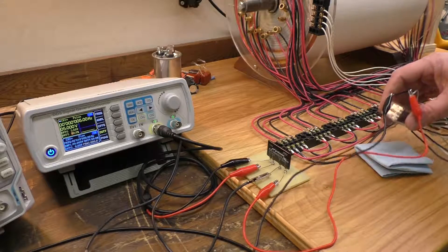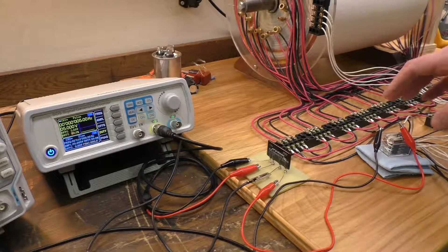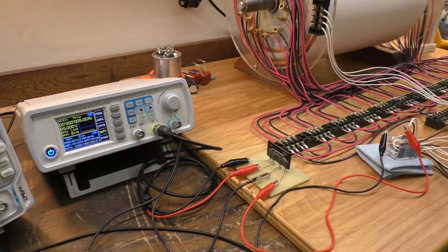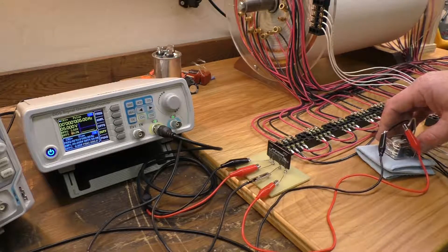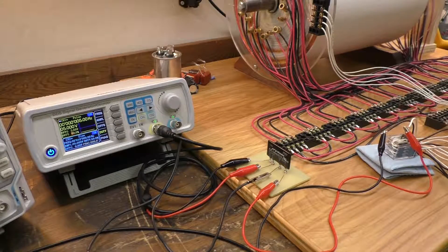So I decided to use a standard four-pin double-throw relay. I originally had an automotive relay there, but I let the coil run for seven days — the relay cycled over three million times — and it seemed like it was getting a little tired, so I bought that relay instead. A 12-volt power supply is just running the coil on the inside of the relay.